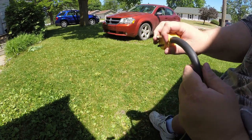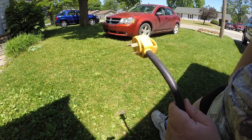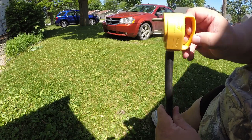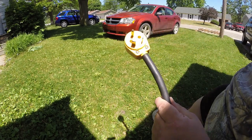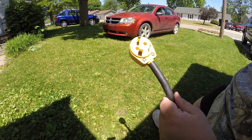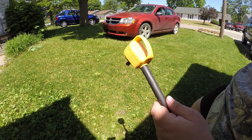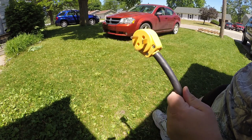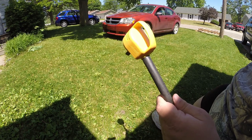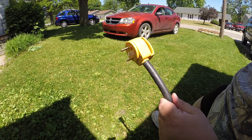Keep in mind these are not waterproof — I don't think any of them actually are waterproof. These are usually inside of an electrical box, so that's usually not an issue. Or if you have a surge protector that hangs down, it does have a little lip around here to try to keep water out if it's sitting straight up the way it's supposed to be. This is a pretty simple fix — I think most anybody could do this. The surge protectors you buy will tell you if you have an open neutral or if you're wired wrong, because it's important. You want to make sure power is coming to your camper the way it's intended. If it's not, you'll end up with problems — your air conditioner burning out, breakers tripping, and weird things going on. You want nice clean power coming into your camper.